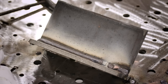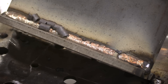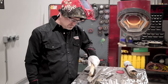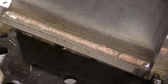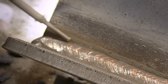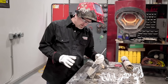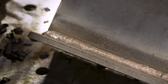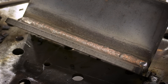So you can see I got my final pass on it. I'll chip it off — it should just fall off just like that. Hit it with a wire brush, make it look real pretty and shiny. I got really good color — it looks really good. I had to stop and restart, and the restart looks good. You can definitely tell how well it tied into the carbon — nice and uniform bead. It kind of overlapped just a little bit more than I wanted, but it's still fine. Tied in really good to the stainless too. The profile of the weld looks really good — shining, got a little gold in there. It turned out really well.